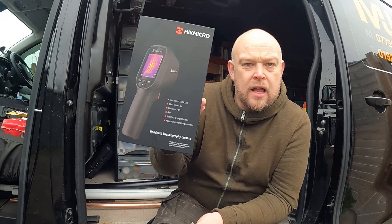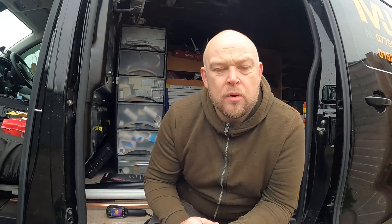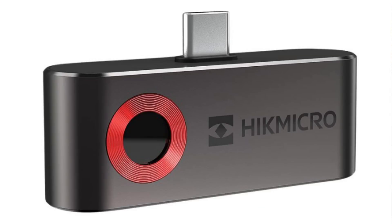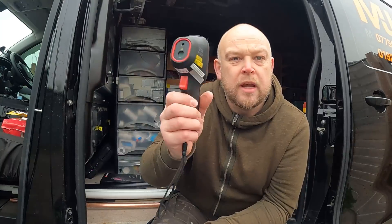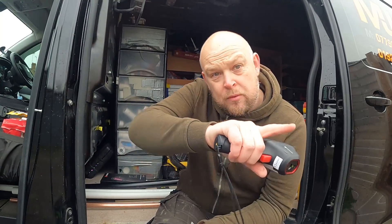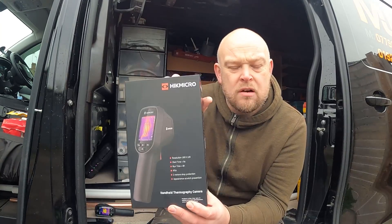Price-wise, this one is £299 plus VAT — I'm getting 15% off, so I'll bang a link in the description below. HikMicro also do a small mini unit that plugs into the bottom of your smartphone, and they've got an app that relays the data from that small thermal camera into your phone so you can screen record it. It's a great selling point for your customer — if they've got a cold radiator and they can physically see the cold spot on the bottom, then once you've flushed the system and the whole radiator is up to temperature, the customer has complete confidence in what you've done.